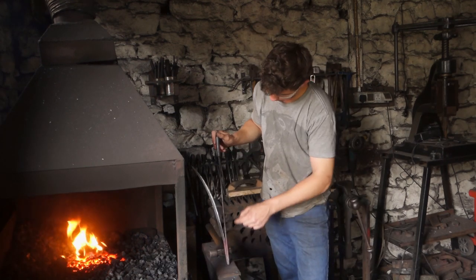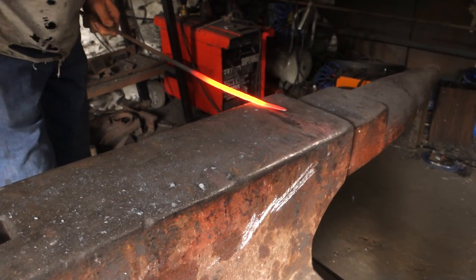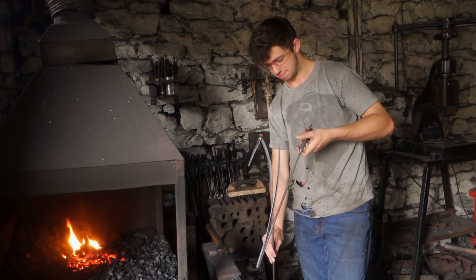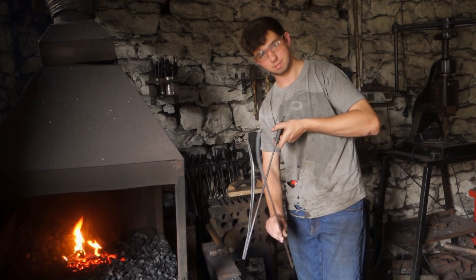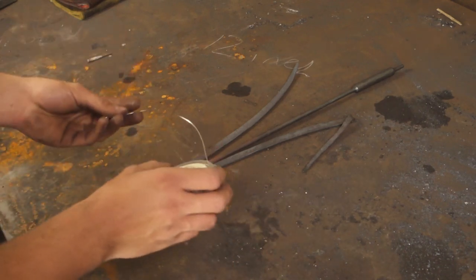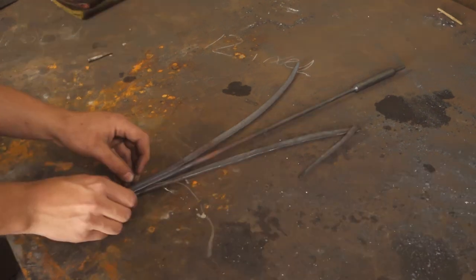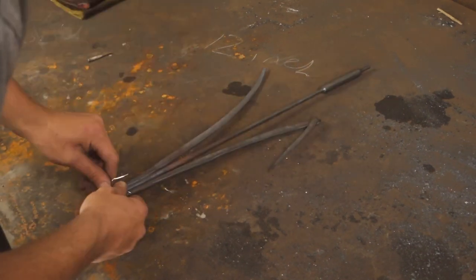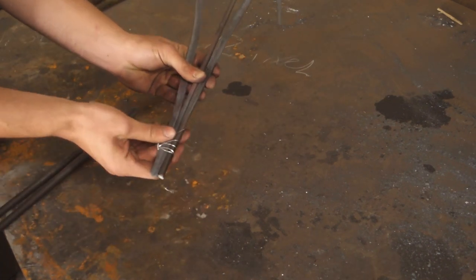My plan now is to make another leaf which comes off there, so I've got to make that and then we can forge weld it on. I've realized I've bent this leaf in the wrong way, so I'm going to have to unbend it and bend it going the other way, as I want it going on this side. The cup is on the wrong side, so I'm going to unbend it, bend it around, and then we can weld it on. We've got our two pieces now ready for welding. The traditional way to do this is to wrap it in some wire so that they're held together whilst we get a welding heat and weld them together, then you can just take the wire off afterwards. We've got these together nice and tight, so we can put this in the fire and now weld these together.